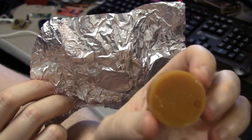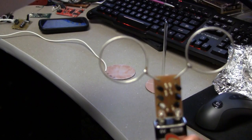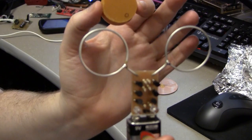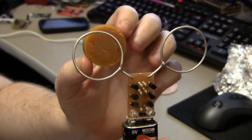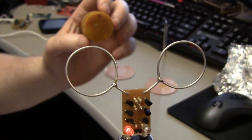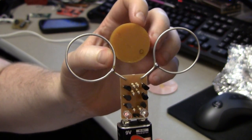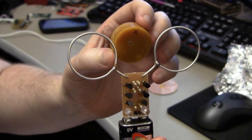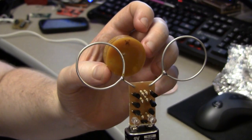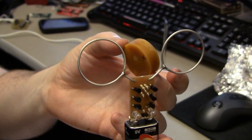It's actually raising the hair on the back of my hand. If we take our electrometer and approach it with one side, you can see that the red LED lights up. Now if I turn it around, the blue LED lights up, and you can note that when I pull away, the opposite LED will light up. The actual electric field from this isn't that strong, but this electret hasn't been made for very long so it's probably still in the process of reversing. I've marked each surface and I'm going to test it again tomorrow to see if it still has the same polarity.